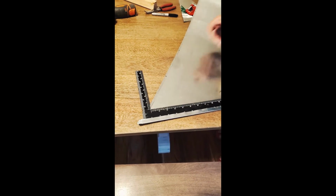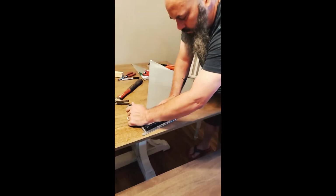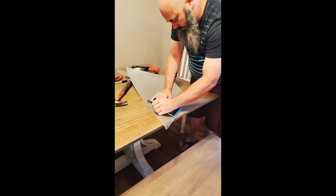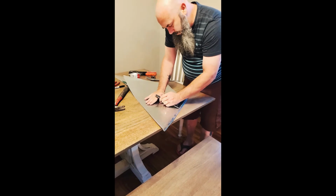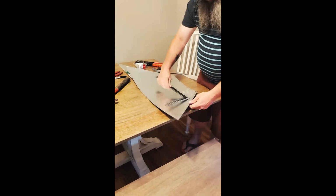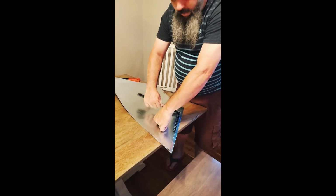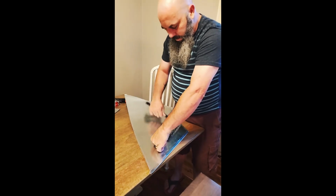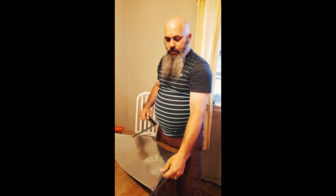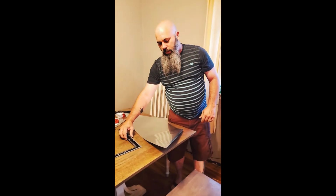And then from here, now that I got it flat where I want it, I'm just going to bend it up a little bit all the way through. Just a little bit. That enables that metal to slide behind it a lot easier. The reason I flatten it completely down versus not bending it all the way is because it's still relatively flat back here. So versus having a real wavy thing, it wouldn't seal very well around it.